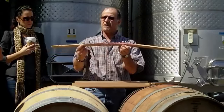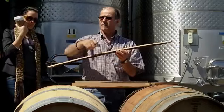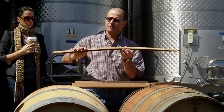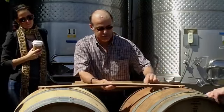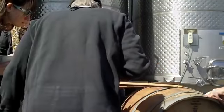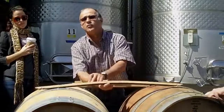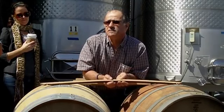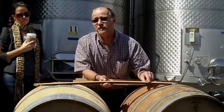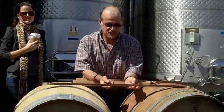The wood is made of capillaries, and those capillaries are most of the time parallel to the stave, but sometimes they are just a little bit sideways, like that one. You can see the wood here. So if it's leaking here, it's not coming straight through. It's coming from here and it goes out here. So even if we test the barrel in the cooperage before we ship it to you and it's not leaking, it takes several months sometimes to get outside. That's the way it goes.